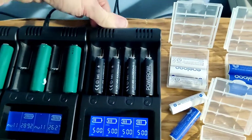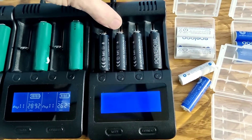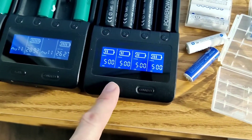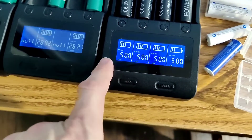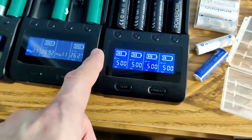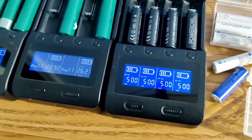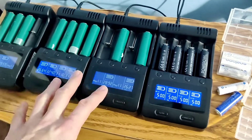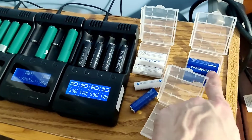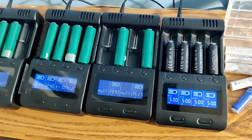So I'm going to unplug the power and plug it back in, that way we can get them all synced at the same time. We will do the normal test and that's going to charge it at 500 milliamps, then it's going to discharge it and then recharge it and give us the full capacity, the resistance and all that good stuff. Once my other cells finish up their test, I will load up the white Eneloops and the blue Eneloops and let all those go through the cycles and I will update you with the results.